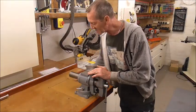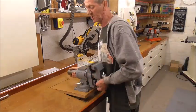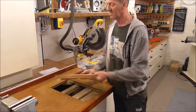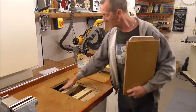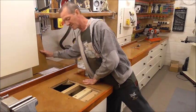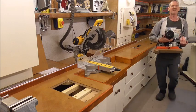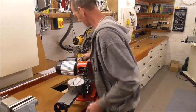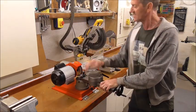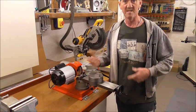What I've done is I have an attachment system on my bench for different things. This vice — very solid, can't go anywhere — but if I want to, it clips out and it's gone. As quick and simple as that. I've got a hole there now, I don't want a vice there, I've got a blanking plate. It just goes in — it's just a square plate, and I've put a plywood cap on the end which hooks into the bottom of the bench and just stops any prying of it. I've used the same principle for the grinder. So I can now, very quickly, put the grinder on. It's quite heavy — 35 kilos — so you don't want to lift it around much. And there it is. Now it's not going anywhere, but I'm working on it. And that is my attachment setup system — permanently mounted on there until I permanently remove it and want it somewhere else.